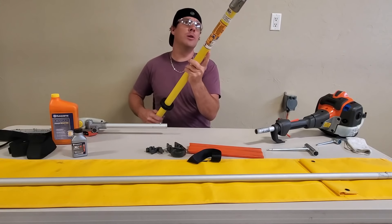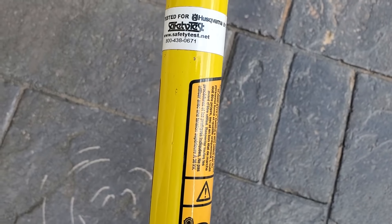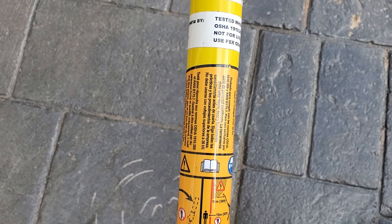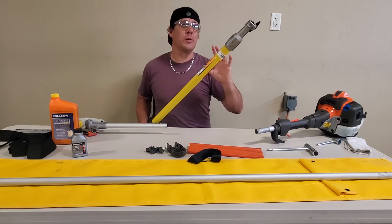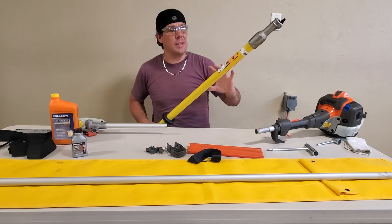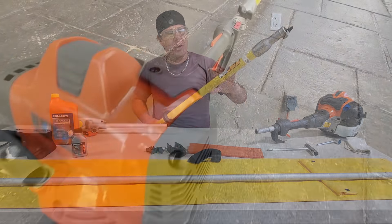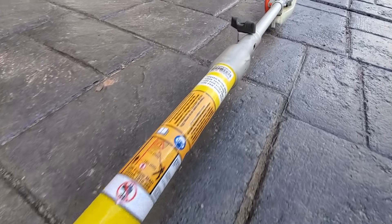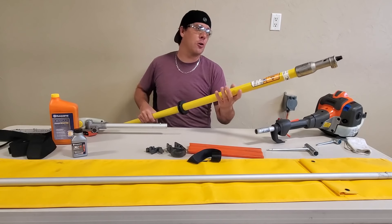There are quite a few stickers and warning labels on the stick. First, tested for Husqvarna by SafetyTest.net, as per OSHA 1910.269. There's one very important phrase in that — it's tested when new. These sticks are tested at 100,000 volts per foot. That's when new, when the fiberglass is shiny new, there's no scrapes in it, no dirt, no debris, no UV damage — all that stuff that affects the dielectric integrity of our equipment.